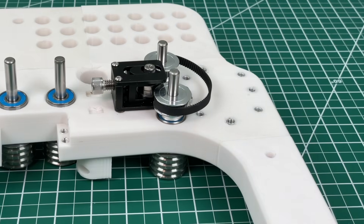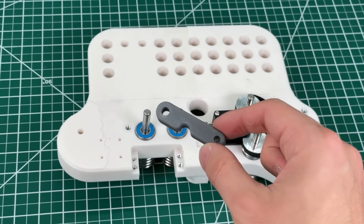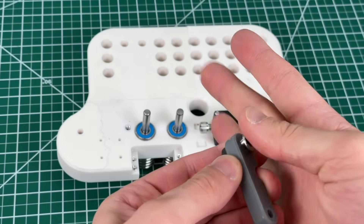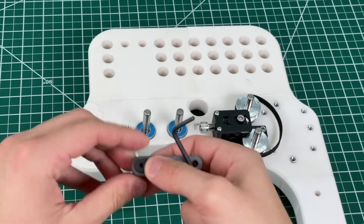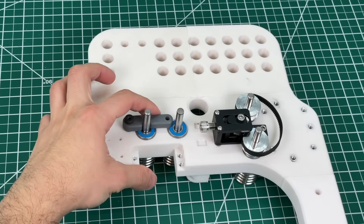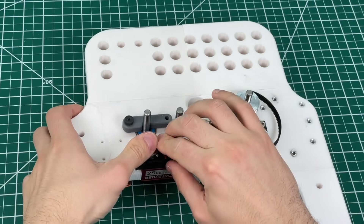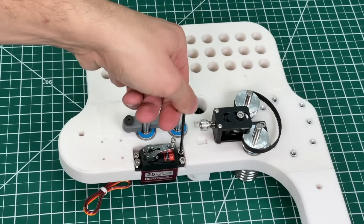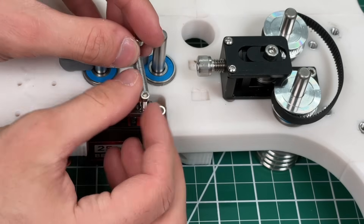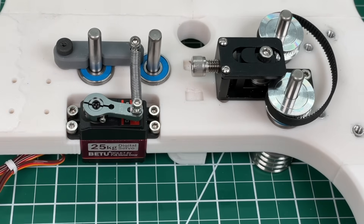Before we tighten the belt, I want to install the brake system. The way this works is we have a brake pad which we put on a pivot, or a shoulder screw in our case. We put our spacer washer in and install the assembly. As we pull the brake pad down it's going to apply more friction on the drive shaft. To pull on the brake pad we use a 25 kilogram servo, which is the conventional servo you find in remote control vehicles. To couple these we'll use a spring, because using rigid coupling can break the plastic brake pad or overload the servo motor — this way there is give while still pulling the brake pad onto the shaft.